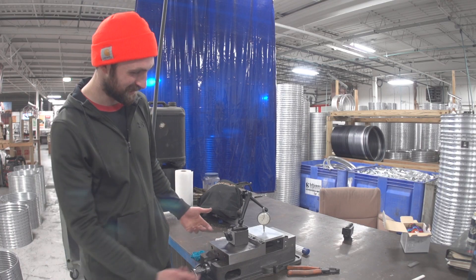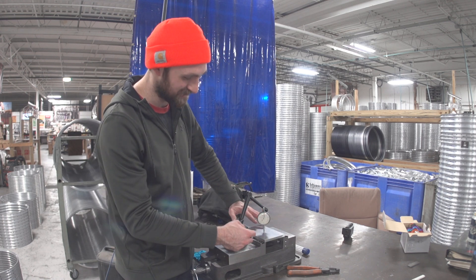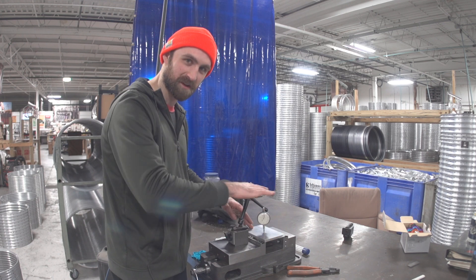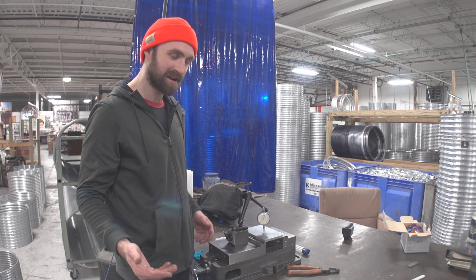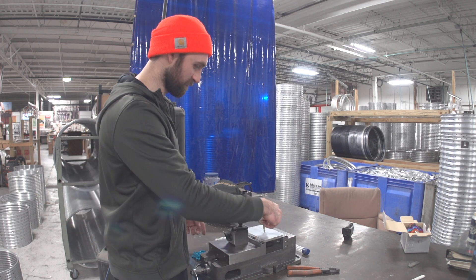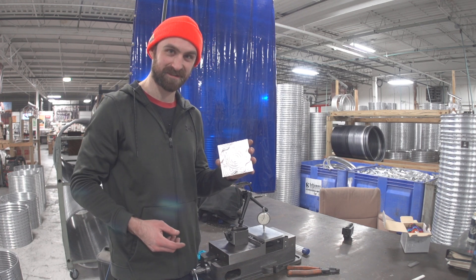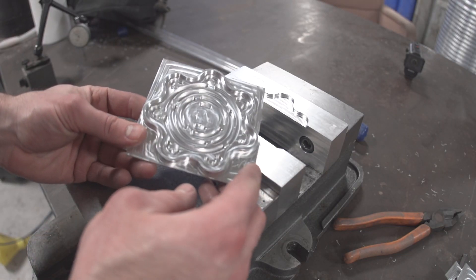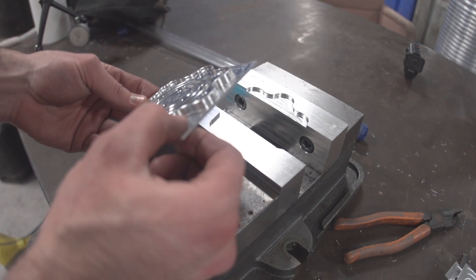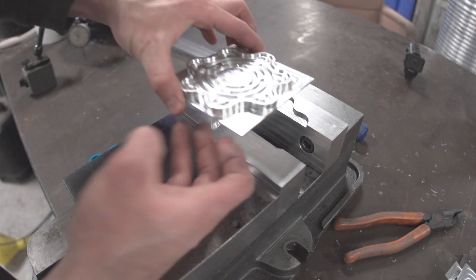The part is sprung up about five thousandths. So you're going to do all this flat machining, and then when you let go of the vise it's going to drop back down, leaving it a little concave in the middle. You might think, it's just a coaster, who cares — except then we have to move on to op two. We've machined the whole top side and we end up with something like this. The first operation is done — the coaster shape is cut out — but it's still attached to the bottom card, which is what we were holding in the vise.